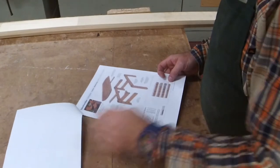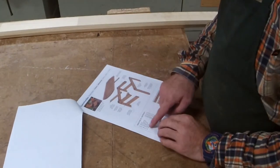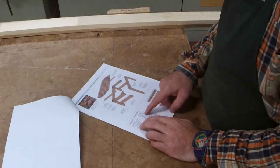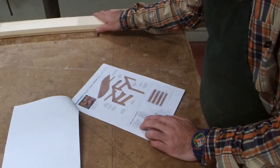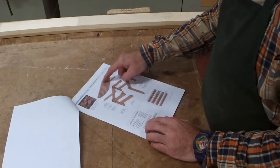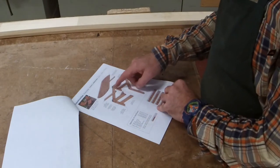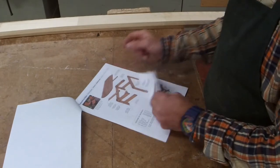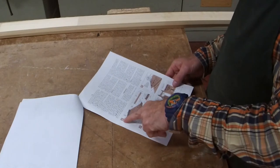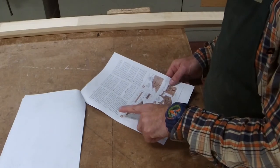All right, guys. We're going to work on the top. What they call the top slats. There's 8 of them. Our material is 65 wide. We've got to thin it down a little bit to 60. Nice and easy. We need 8 of those. Then we need 2 of the cleats. They're 500 and they're 1200. If you're unsure, again, all the dimensions, go to diagram 6. It's perfect.